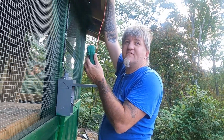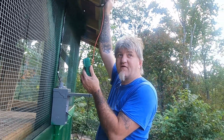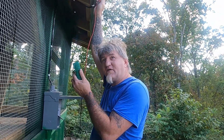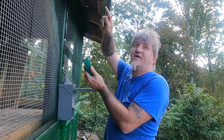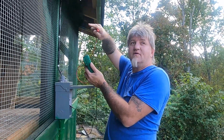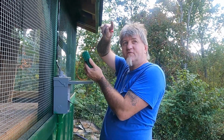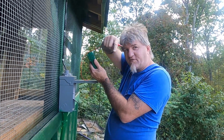Like I said, I've got this row of six grounded to each other and then one wire run to the earth ground. The second row of six grounded together and run to earth ground. And then I wired the two together. Okay, and then the unit struts on the roof, I actually put a ground wire on those, one on each array, and ran it to the earth ground.